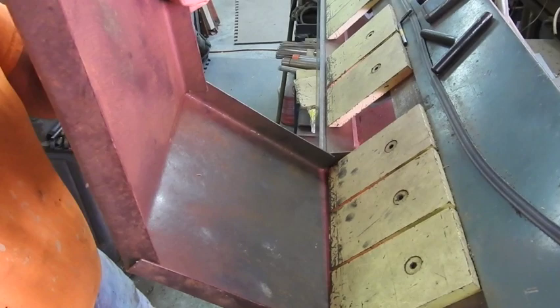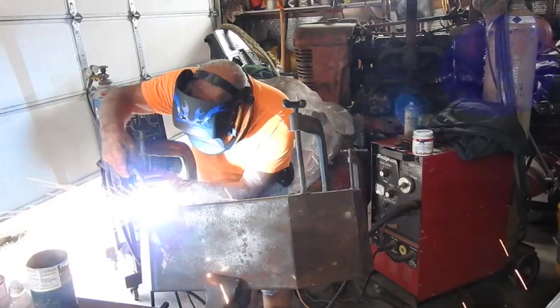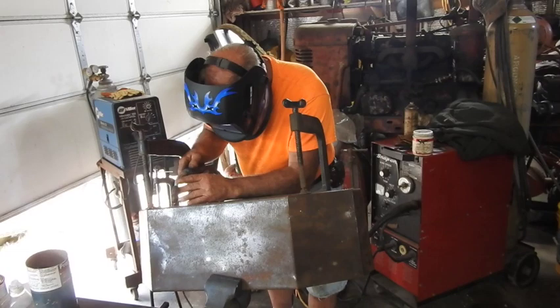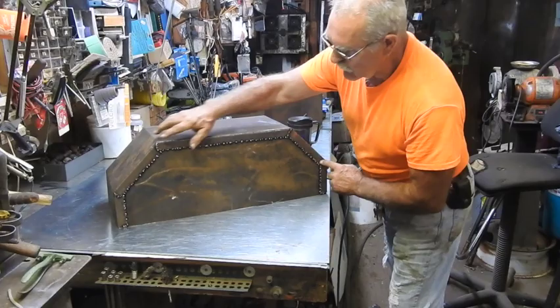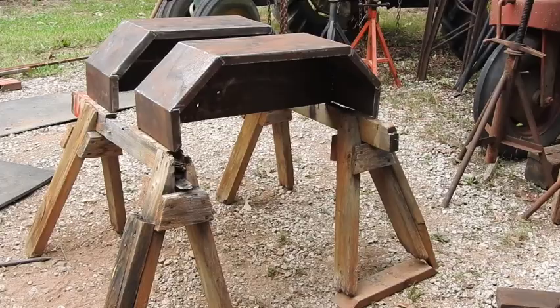And there's the two fender wrappers. It didn't take much to get it clamped in place. We got her stitched all the way around, got all the angles locked in place, got it stitched inside as well as outside, and even got the outside corner stitched. Gotta do the same thing with the other fender. So here are the fenders, ready for painting.